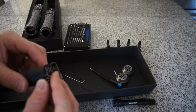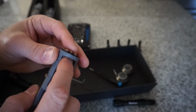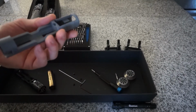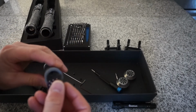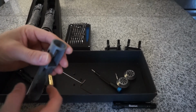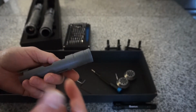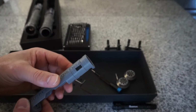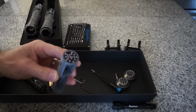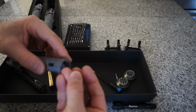Once that's done, again, you'll have to test. It's not a perfect press fit. Sometimes they are, sometimes they're not. It really depends on several factors when printing in plastic and in resin, flow rate and stuff like that. I won't go into a crazy amount of detail, but there's a tolerance, right? Plus or minus a certain amount of plastic. Plus, as it cools, it shrinks, right? Some people can get it perfect dimensionally, but for me, I'm working with an acceptable tolerance. So either it's going to be perfect and press fit, and you won't have to glue it, or you might have to glue it. Sometimes the wires will hold it in place.